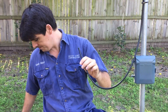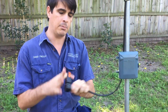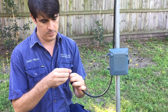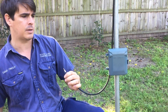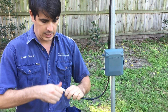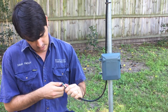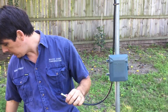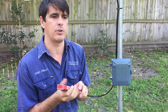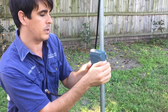I need to terminate this end of the cable now with an F connector. Most amplifiers that you buy will be F type. There are some that use saddle and clamp, but I'd always recommend an F type. This particular one is a King Ray amplifier — an MDA type designed for digital TV. One thing to remember when buying is to always make sure you get the correct band coverage. Some cover VHF high, some cover UHF, and some cover both, so you need to make sure you have the right band coverage for your location.